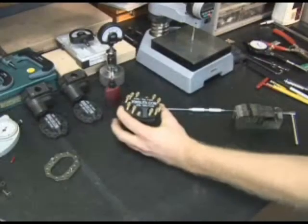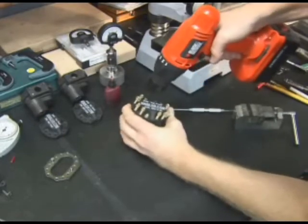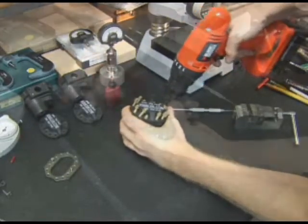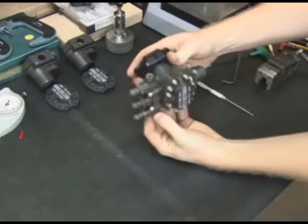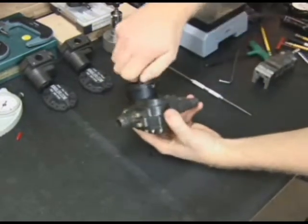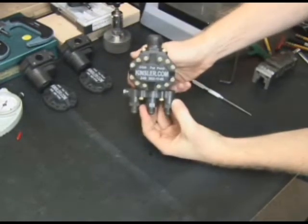Plates are high alloy steel, heat treated, then ground to a 6 micro-inch finish with a flatness of one-tenth of one-thousandth of an inch. They are then coated and lapped to a mirror finish. The Tough Pump gets final details buttoned up and the flange installed before moving to the next stage.